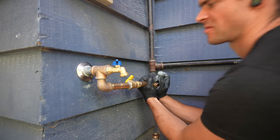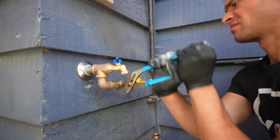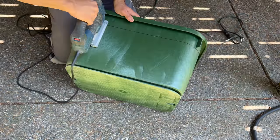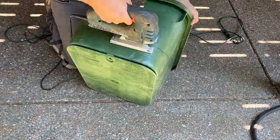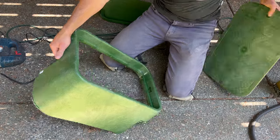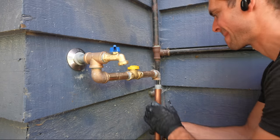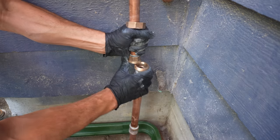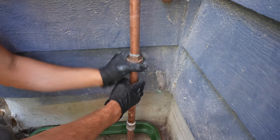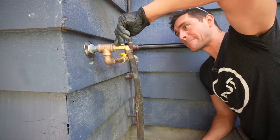This is a lot of work just to get water to your backyard for an irrigation system, but in my personal mindset it's worth the extra effort. Before I install the entire system together, I have to install a valve box — and in this application I can't just install a normal valve box because of where it's located, so I had to cut and shape the valve box to fit this space. It actually wasn't very hard. Once I like the positioning, I can install the last and final piece of pipe — a 12-inch long piece with the other side of the union attached. I maneuver the union pieces perfectly into each other and tighten it down. This is the last and final piece needed for this entire puzzle.